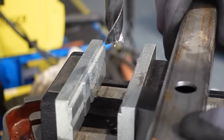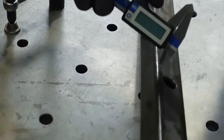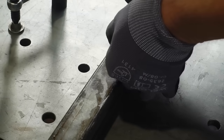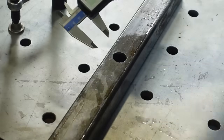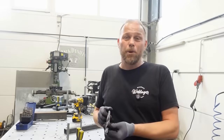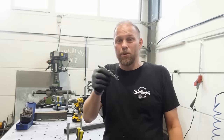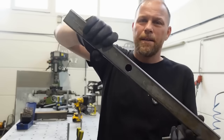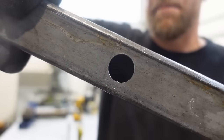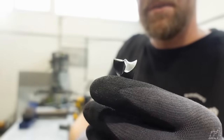Now I'm going to measure that right away. Where's my caliper? 19.1 mm. Let me measure it again — now I can only measure 19.21. So this drill bit has a diameter of 19mm; it's already not in the best condition, it's already pretty bent, it's really taken a beating — I think it's as old as my dad — but still it managed to drill a beautiful hole. This hole is exactly 19mm, or not exactly, because it's a tenth more, but I think it's less than a tenth. It's been sharpened like that.